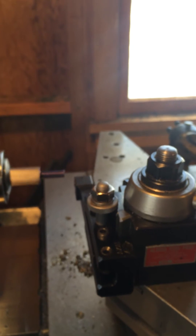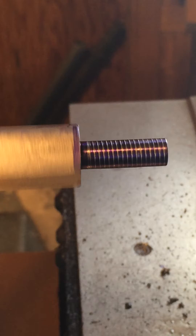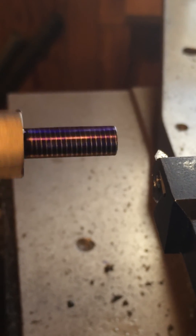We're running at about 275 to 300 revs right now, and I've got a stand-up carbide tool on it. I'm going to try to bring up the magnification a little bit better to show you what we're doing here. And we're going to be threading into a shoulder, which is a difficult operation, so I'm going to engage the left carriage feed for the half nut.